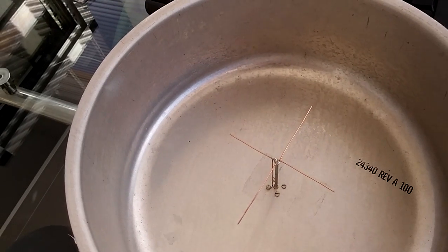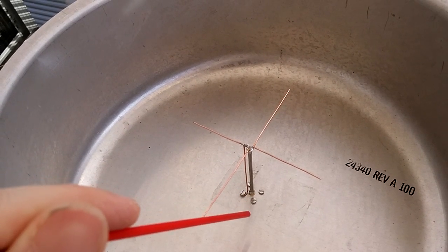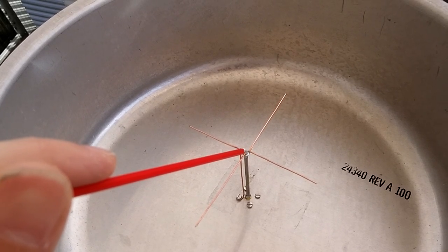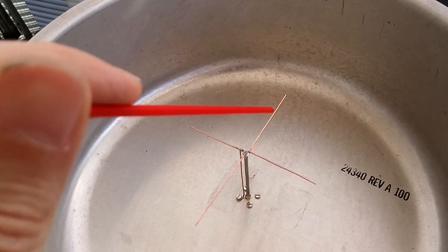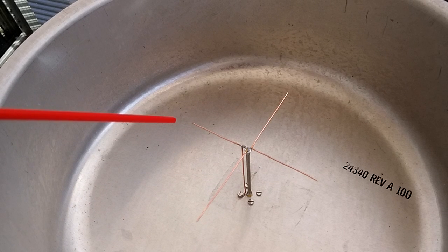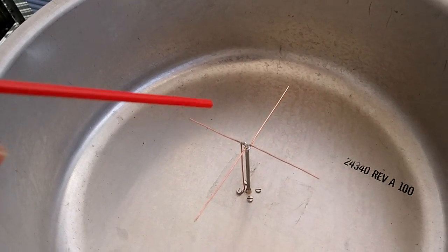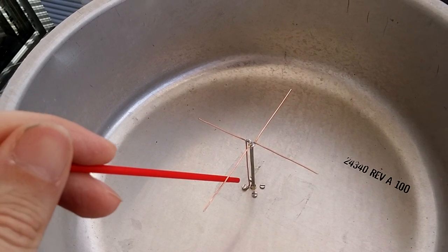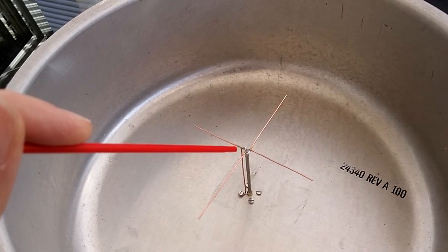The dipole, I'm using the cross dipole, and we can see the distance from the reflector. It's exactly quarter wavelength, and the cross dipole size is 0.52 wavelength and 0.42 wavelength. To achieve the circular polarization, we use that trick. Otherwise, we will have a linear polarization, and the wire going down from the reflector to the dipole is a balun stub.